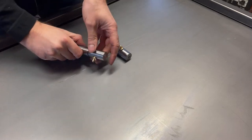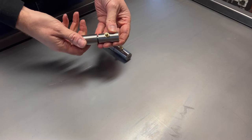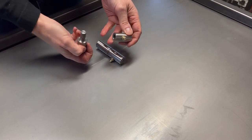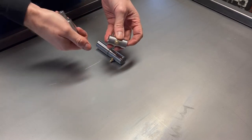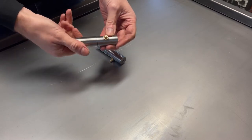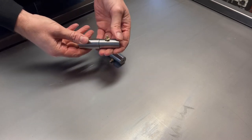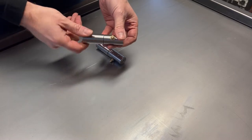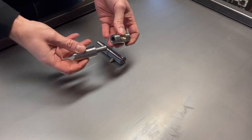And here we are, the finished product. The steel that you've just seen before, I turned these up into a male and female piece. There's a grease nipple in the female piece so that we can keep the hinge greased up all the time and keep it moving nicely. This steel is really hard steel. It's not the greatest quality steel, so my lathe wasn't super happy about turning these up. Check the link below for the video where I made these.